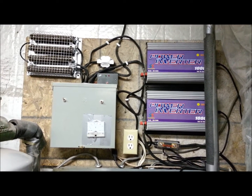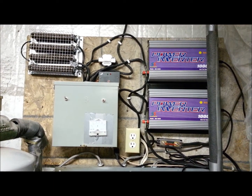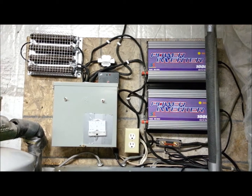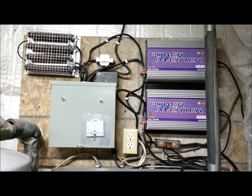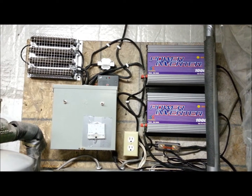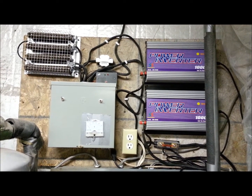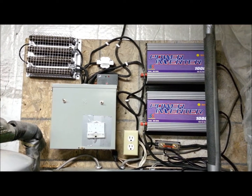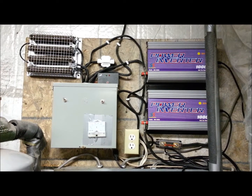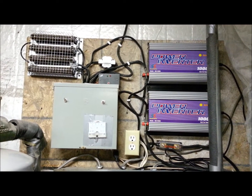The first system I put together was a 1600 watt 8 magnet unit that wouldn't start until I had 12 to 15 mph winds and didn't produce power until I got to 25 mph winds. It just didn't work for my area. So I'm hoping that my second choice works out and I also hope that I can get some posts and put together some information about different units and maybe find something that will work better for me.